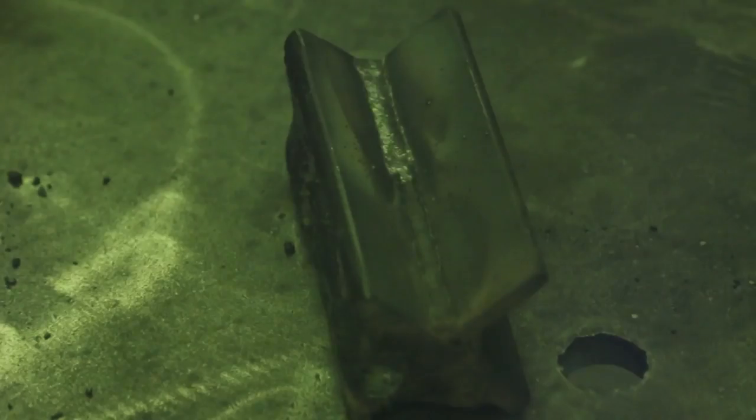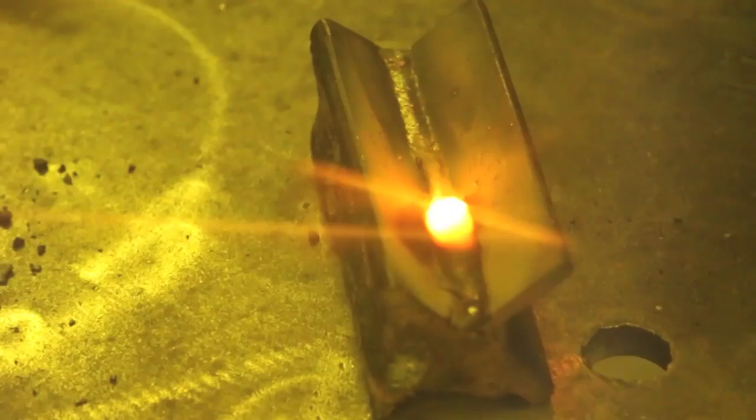The goal here is to get it nice and hot so I can fuse all that previously — and poorly — laid down weld bead. You can see I'm going side to side in real time. It looks very slow, but there's a purpose: I need to get it good and hot so the molten puddle fuses properly and hopefully breaks up that poor weld underneath. I definitely want to hold on the sides to get good penetration and good fusion along the side walls — the last thing I want is any more poor fusion than what's already there.